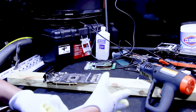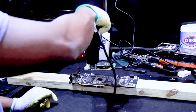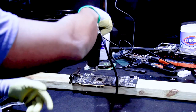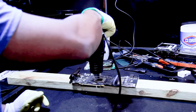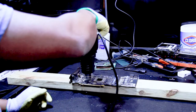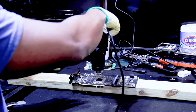Once the timer beeps, we'll stop. This thing is hot. You want to move the heat gun around, keep it circulating, and kind of focus the attention on the actual GPU chip and then go around the board. You don't want to get too close because you don't want to nick the GPU. It would have been much better if I had an actual thermal reader so I could tell what the temperature is. But I can say for a fact this is much hotter than the hair dryer.